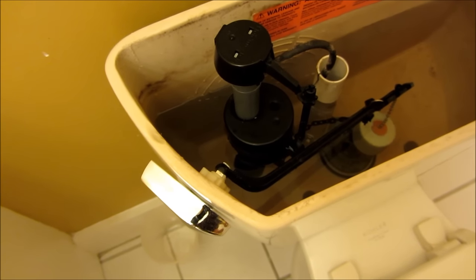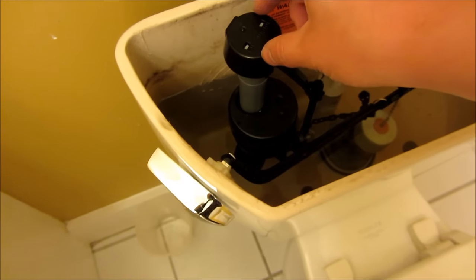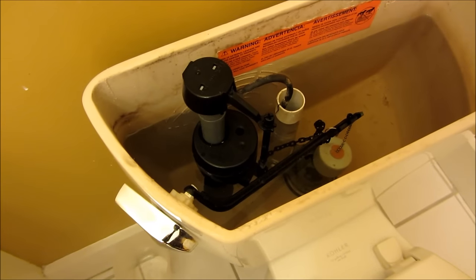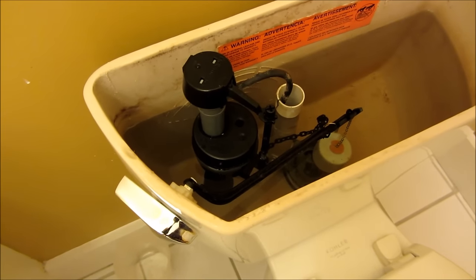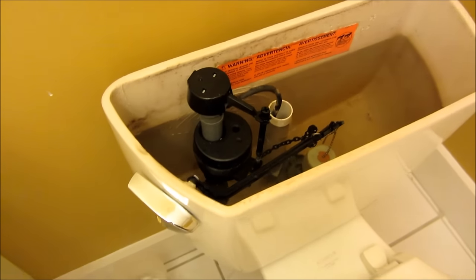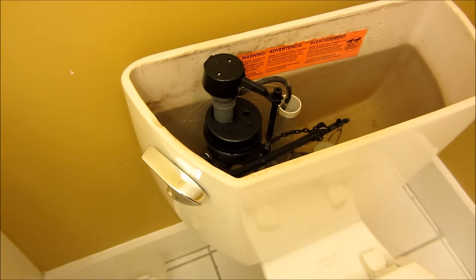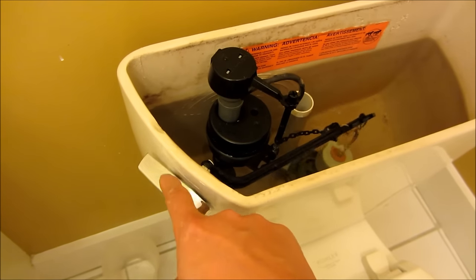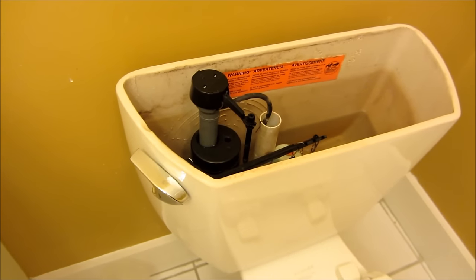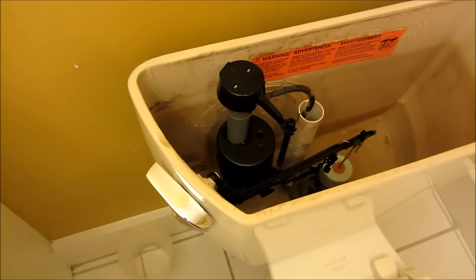I'm not sure what that actually achieves, but that is the step to getting rid of that vibration — closing your cold water main, and then opening up all the water faucets, whether it's the kitchen, bathroom, or tub. Once the air is gone, turn on the cold water main again, and then open up this cold water valve.